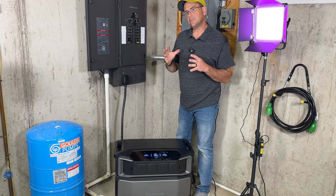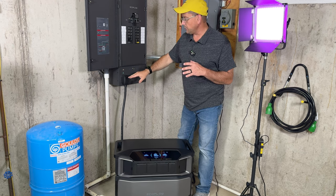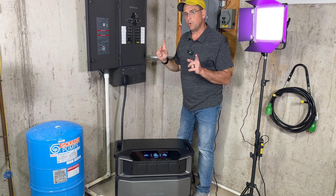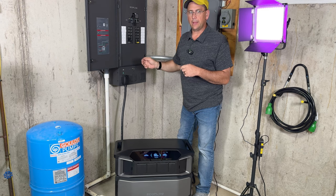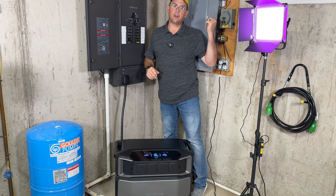You've got to understand, this is actually communicating more than just power through these cables. There's actually multiple different pins in there, and it's keeping track of the amperage. It's keeping track of the voltage. There's a lot going on in here besides just sending power to it like you would with a generic inlet box here on the side of the breaker panel.